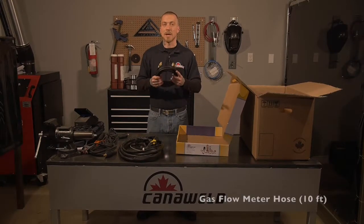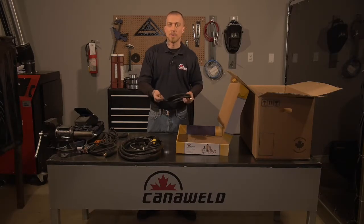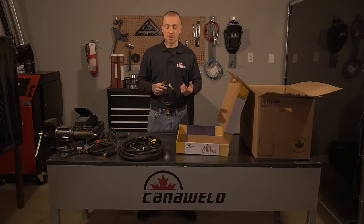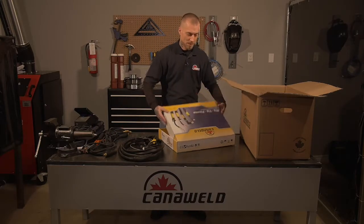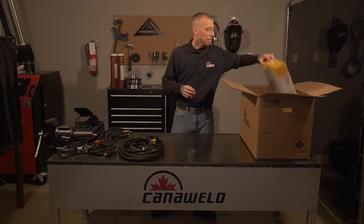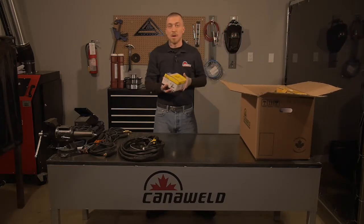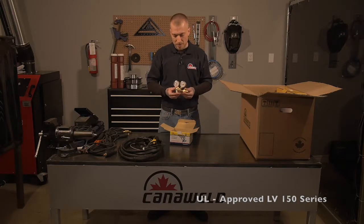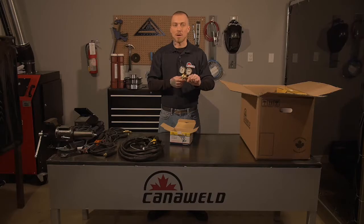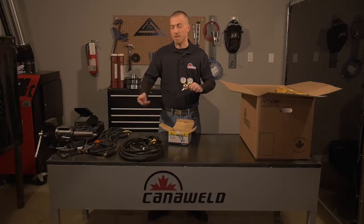We also have our gas connection hose for hooking up when we're doing our TIG welding. You can see it's the quick connect, so you just pull it back and slip it onto the back of your machine. It's really nice — you don't have to worry about carrying a crescent wrench and slowly rounding off the nut. We also have our regulator. It's nice that the kit comes with this so you don't have to go out and buy it. These are the standard brass regulators. This part hooks up to your bottle of argon, CO2, or mixed gas, and this part hooks up to your torch. You use the set screw in the front to adjust the flow of gas towards your work.